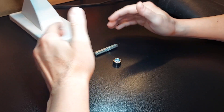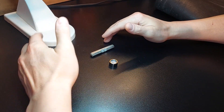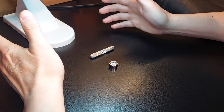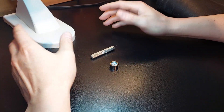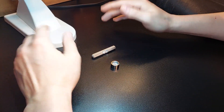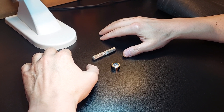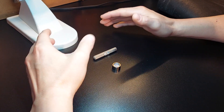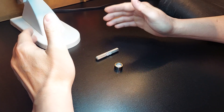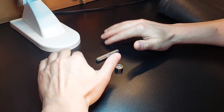What we usually see in the industry when it comes to assembling anything with robotics — whether it be a plasma table, a mill, a router — is that the instructions typically say, assemble the chassis this way. You see all kinds of videos all over YouTube with a guy just putting the screws in and they assume that the chassis is done. For my novice guys out there, that's the beginning of the process. You have to set up the chassis as you go to make sure your gantry is level to your actual spoilboard or your actual chassis frame.